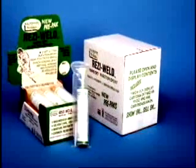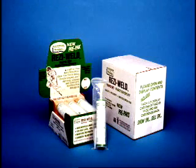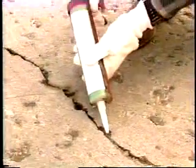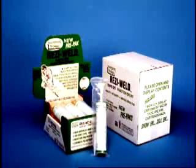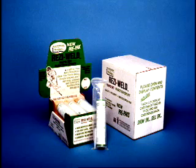Seal-Tite Resi-Weld Rapid Set Injection Epoxy is a clear, two-component, low viscosity compound that is penetrating and sets quickly. It's a high modulus, high strength, self-leveling material that is also resistant to many chemicals and moisture insensitive. Rapid Set is convenient, fast, and easy to mix and use. It's designed to be either gravity fed or pressure injected into concrete cracks for restoration of bridges, buildings, highways, or a variety of projects such as sealing small cracks in concrete surfaces, bonding cured concrete or metal to concrete, and setting anchor bolts in concrete. Rapid Set is pre-packed in two-component barrier-type cartridges, which require no special mixing nozzle. When properly mixed, each cartridge contains 10 ounces of low viscosity epoxy and may be inserted into a standard caulking gun for application.